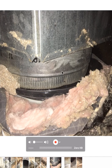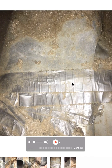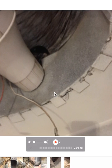Here's another spot where the zip tie is down here — it's supposed to be up over the top of this collar but it's not, and as a result we've got a disconnect. Duct tape — anytime I see duct tape, I take pictures of that stuff because that's garbage in the attic. This isn't good to have in the attic as it restricts airflow. This is inside of the return — you can see the leaks. A pinched line because it's not been run or strapped properly — this is reducing airflow.